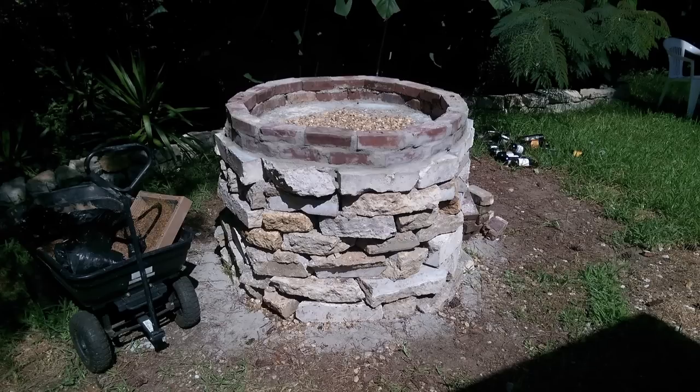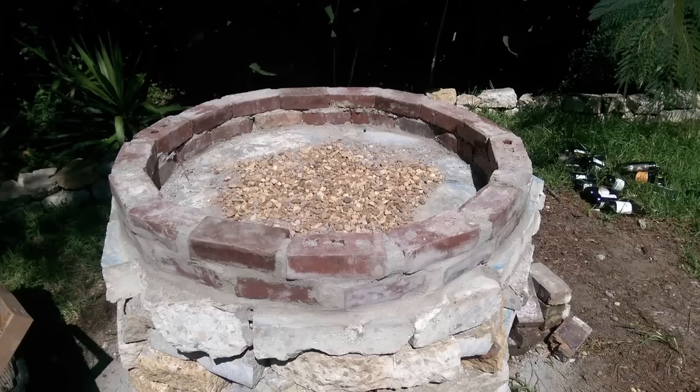The next step was to take that flat surface and start building a couple of rings of brick to hold the wine bottle insulation. The idea with an oven like this is that you put fire inside, heat everything up, and there's such a mass of clay that gets hot and stores heat. You pull the fire out and then you can bake for a very long time. Part of the reason you can bake so long is because there's insulation to keep the heat in that massive clay. The hearth floor is where the fire sits, heat is transmitted to a big thermal mass of clay underneath, and the insulation keeps that heat from leaving down into the foundation.